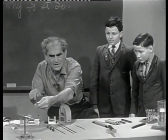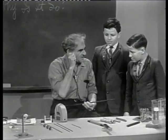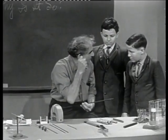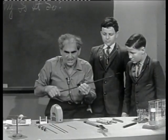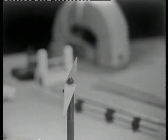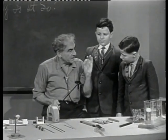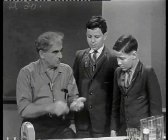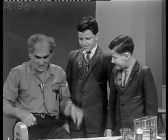Watch — oh, it did! Did you see it push that away? Which leads me to say that the only test of whether a thing is magnetized is not attraction but rather repulsion. Repulsion is the only test as to whether a thing is magnetized. Watch it again — notice, is it not noticeably pushing that needle away? So repulsion is the criterion for answering the question: is the bar magnetized?